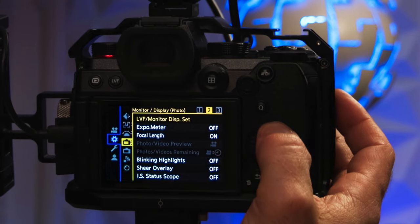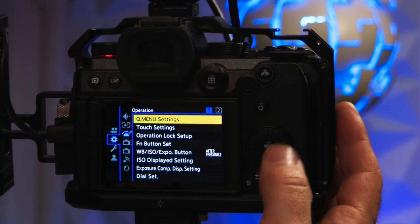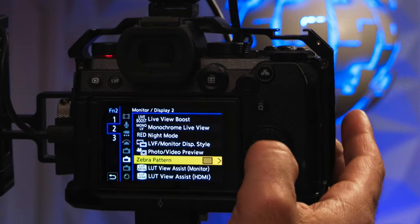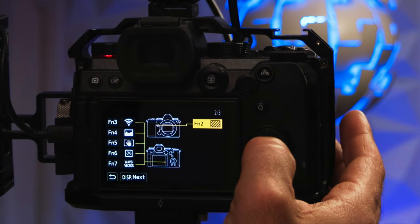Since you are using the HDMI feature, V-Log is the default on the color style, which enables the stop feature for the luminance spot meter instead of a percentage. So by setting your base level to 0, this is the same thing as 42 IRE or middle gray. If you want to assign the zebra to the front button, select the gear icon, third icon down, select FN Button Setup, go to page 2, select FN2, select List 2, six icons down, select Zebra Pattern, select Zebra 1.